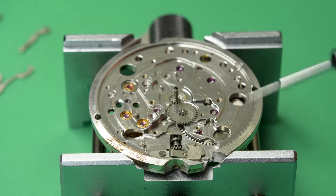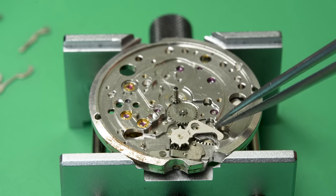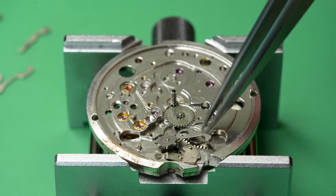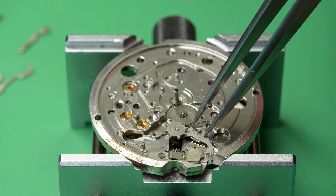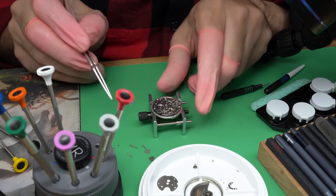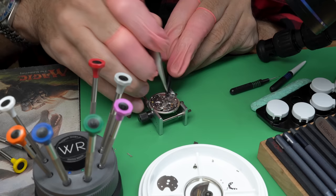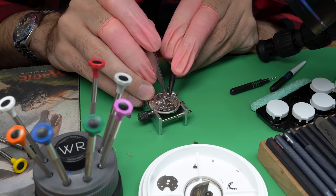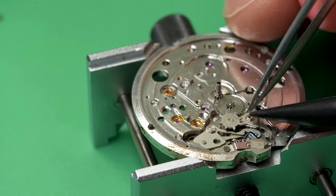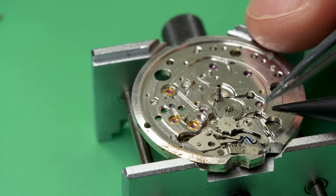They came up with a quick-set mechanism. When you pull the crown out on your watch — pushed all the way in and you turn it, it'll wind the watch; pull it out and that's where you can set the hands. Well, this one actually has a setting in between: you pull it out a little bit and it's got a quick-set date so you can turn it and it'll just turn the date day by day very quickly. So you can just pick up the watch, get it to the date you want right away, pull the crown all the way out to set the time, push it back in, put it on your wrist, and off you go.